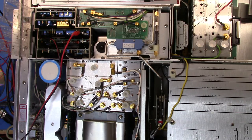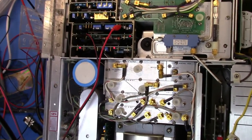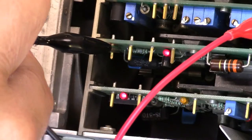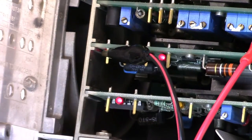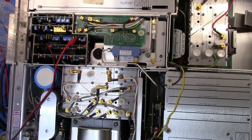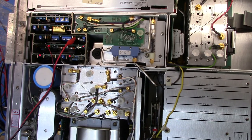There's a ground pin and the 40V pins here. Using my meter I can check that this ground is actually chassis ground — and it is. I'm getting 58V across the chassis ground on the unregulated supply, which is always live since it heats the oven. So I should be able to take lines from my bench top power supply, drop them in — minus 40V there, plus to the ground — and my lab supply will be referenced to chassis ground providing minus 40V.